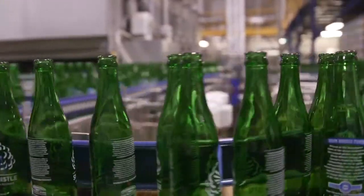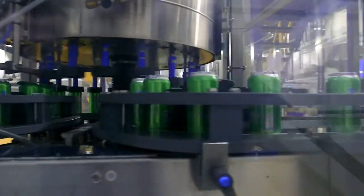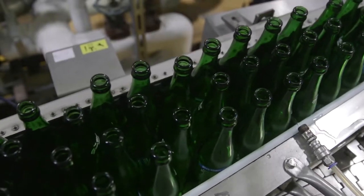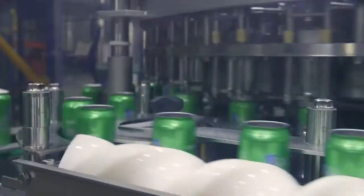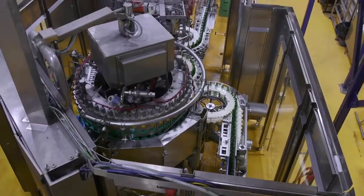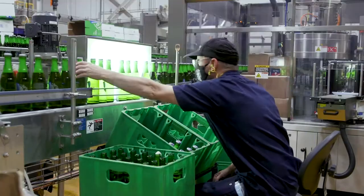There's a very small difference in different packaging formats. Our job in the brewery is really to make that difference as small as possible so that the product is consistent across all the packaging formats. One of the biggest things that we're trying to avoid is any oxygen pickup, which will really reduce the shelf life of the beer. For example, whereas a bottle has a small opening at the top between the bottle and the cap, a can has a little bit of a larger opening between the can and the top of the can. So when you're filling those packaging formats, there's just more surface area on your can and more chance for oxygen to get into the beer. Our main job is really to eliminate the possibility of oxygen getting in, and working with really good equipment and constantly checking and calibrating that equipment is really key to upholding the quality in all the packaging formats.